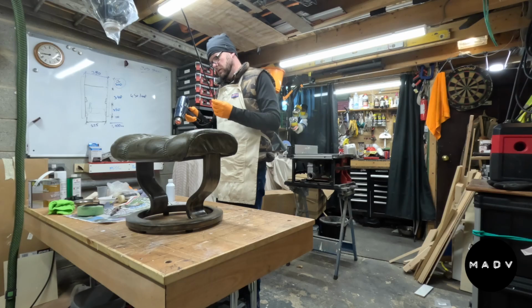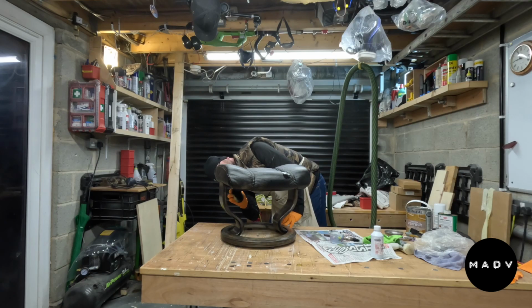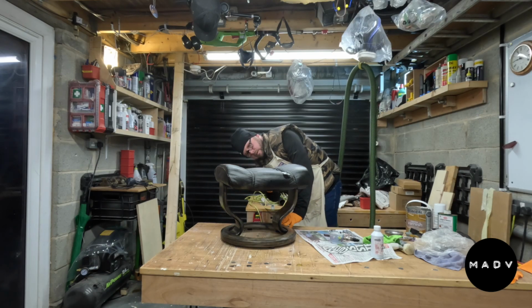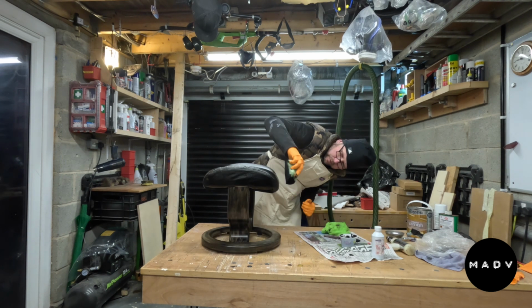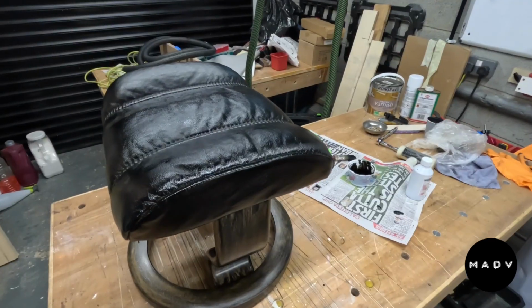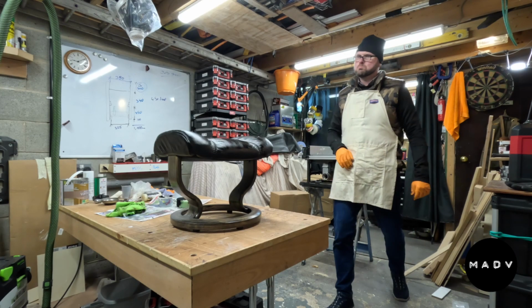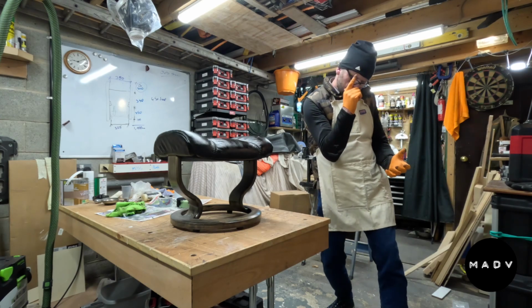In terms of general tips, I would say take your time with it. Probably do it in summer rather than winter because it goes on better. The consistency for this particular product is a bit like a very thin boot polish. It goes on but can easily leave streaks if you don't take some time and work them out. But once it is done, it looks gorgeous.